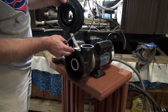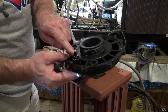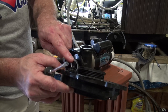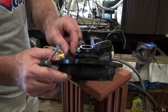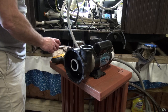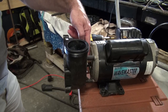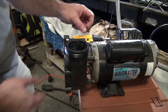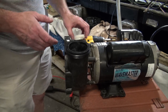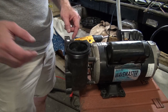There's another style where the seal is in a groove on the other side. Also on this particular Watkins product, you can see it's got the smaller bleeder that screws in — it's got the little tiny nipple on it. I'm going to see if I can put something in here to hold the shaft. I'll try to put small vice grips in there and then grab this. You can see it's got a wear ring on it — this should be a two and an eighth. This is an XP2.